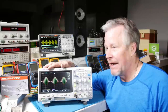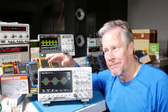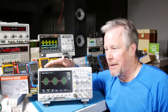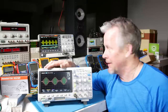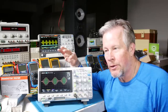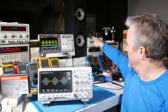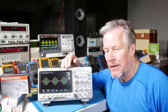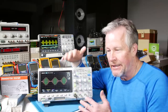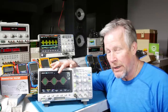I think 50 MHz would work fine. My first scope was a 40 MHz scope and I don't remember not being able to do everything I wanted to do with it. My bench generator back then was 1-2 MHz bandwidth; this one's 10 MHz. There's a rule of thumb: get a scope bandwidth that is four times faster or wider than the thing you're going to measure. This generator is 10 MHz — four times that would be 40 MHz, so a 50 MHz scope could see everything without distortion in amplitude.